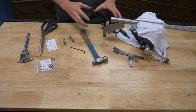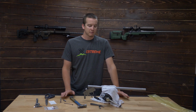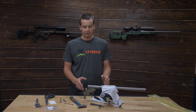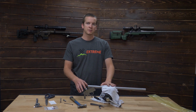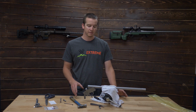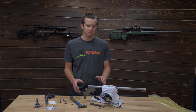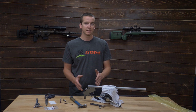And hopefully this will alleviate an issue that you may be having with one of our barrels. So as time goes on, since Smith & Wesson has purchased Thompson Center, we've seen their tolerances in their frames grow worse and worse with the modern frames. Obviously, there may be some different tolerances in some of the older frames as well. Our test frames that we check headspace with, we try and make sure they fall in line with the vast majority of the frames that are out there. We test them continuously as we go. So if you happen to have a frame that's out of that tolerance, we apologize, but it's beyond our control. We're doing our best. Thompson Center needs to step up their tolerances on their end.